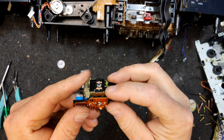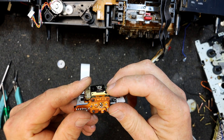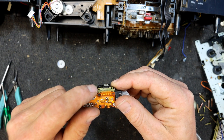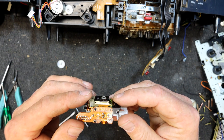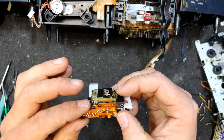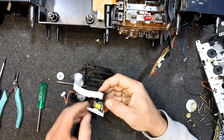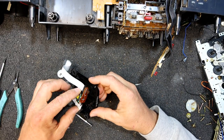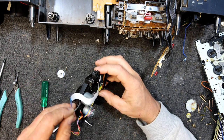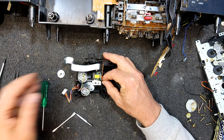So yeah, this little cover's got a little indent in that gold bit of metal. That's where two little bits you've got to slot under, and then the other bits just click down where that other little hole in the metal is. And that's our laser on the back there, those three pins. That's the laser power potentiometer. So yeah, slot that side into the plastic, so the plastic goes in that little forked bit or whatever it is. And that should get that in there.